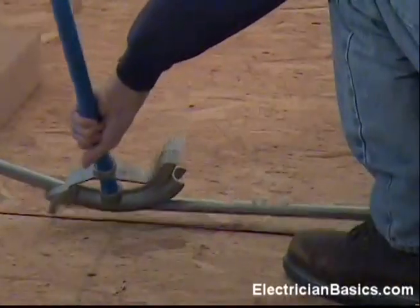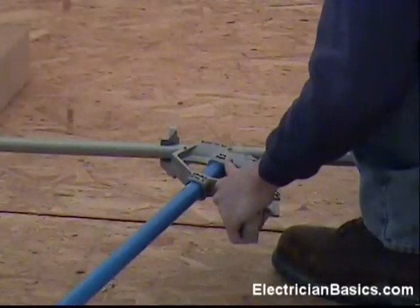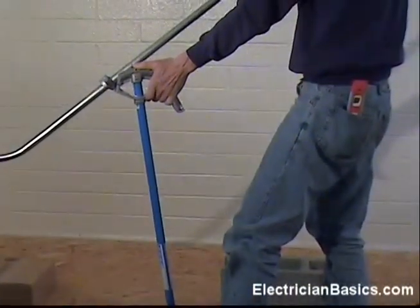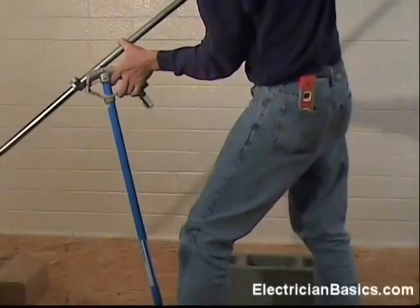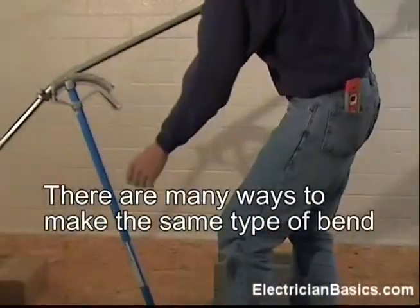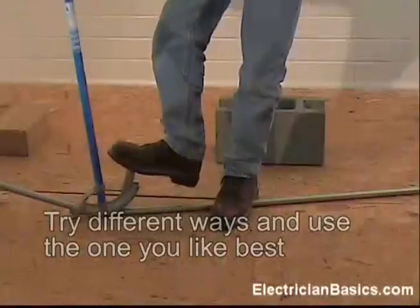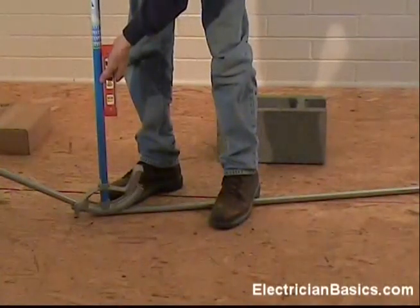Now the next bend — put the mark at the star. I'm going to line up my position, put it on the pipe and rotate it. Now that I'm nice and straight I'm going to start this off. The last bend we made with all air bends; this one I'm going to use a slightly different technique. I'm down to about 22 degrees, so I'm going to flip it over onto the floor. When I know that my bender handle is straight up and down, I'm at 30 degrees — and there we are, 30 degrees.